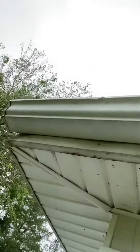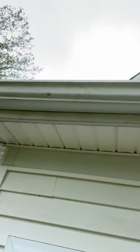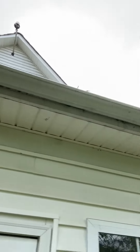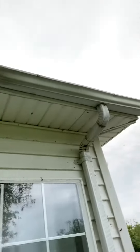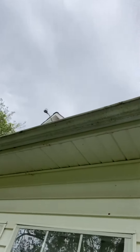I'm looking at the edge of the fascia right here. You can see that the water's come behind the edge of the fascia — you can see that discoloration. And some of that certainly could be because these gutters are not doing so well. You can see all that discoloration right there, right where the fascia meets the soffit.